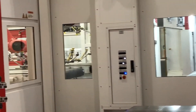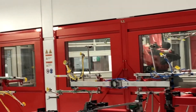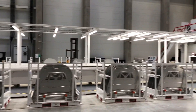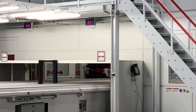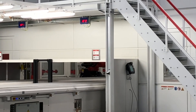After this fifth press station, the components are put onto a conveyor belt that leaves the stamping housing. At the side of this last station, two red doors can be seen — both are again tool changes for robot end effector exchanges. The last part of the stamping press street is the conveyor belt on which the components exit the stamping house, and here they can be put into the transport jigs for the next step.